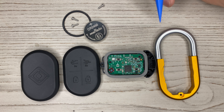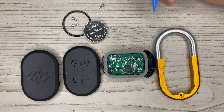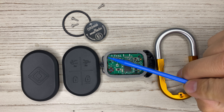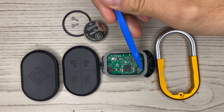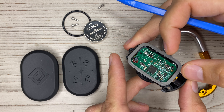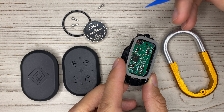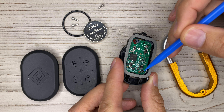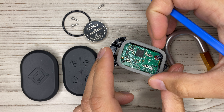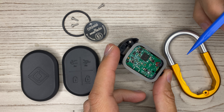There are four buttons which trigger certain functions on your key fob. Looking down here, in every corner you can see they put glue in all these corners — they glued the circuit board in place. Typically I would like to see snap hooks, ultrasonic welding, or heat staking where the plastic comes through the circuit board. It looks like they just put a little glue to hold it in place, which I found to be kind of unique.